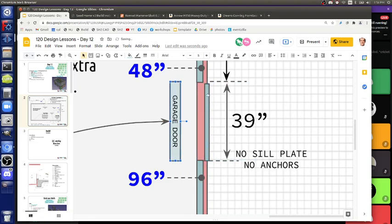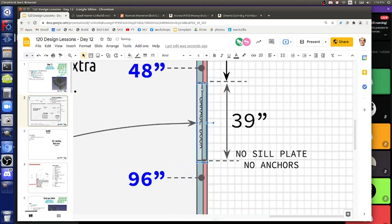We cut that out. It's already cut out, but the piece we cut out, we put there, and we got to remove the insulation from that. We got to slip the insulation because the insulation is all over right now, everywhere. So we got to just cut it with a razor and take out the insulation, but only enough for the board. You're not cutting all the way down. You're only cutting out 3.5 inches vertically, because that's what the board is going to replace that insulation with, a ram set. Does that make sense? Can you picture that? Or no?